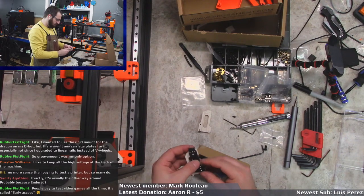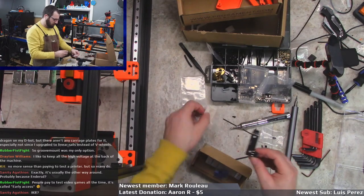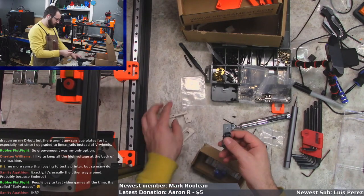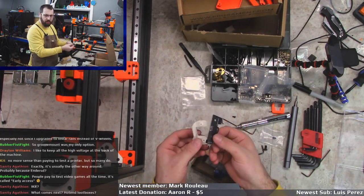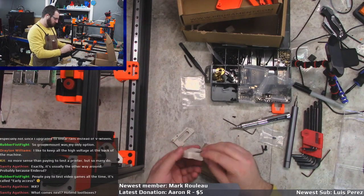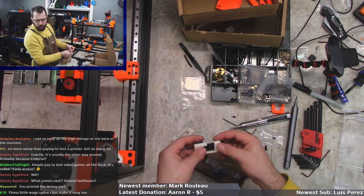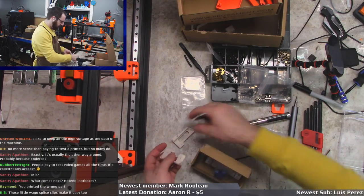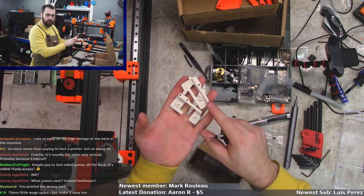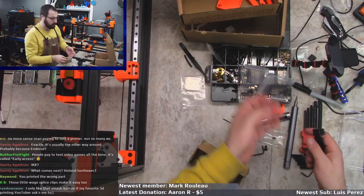Okay, so their screw holes don't line up with what's in here for the PCB board, and then their screw holes don't line up with this board. So I'm gonna have to find wherever the file is for this one and print it, because this one won't work. I printed the standard one and the one you screw the KW10s in and the one that uses the Hall effect. I thought the board used the same screws as the Hall effect. I guess I was wrong.